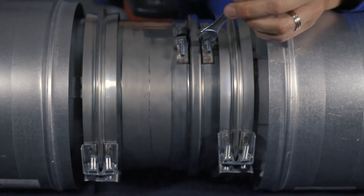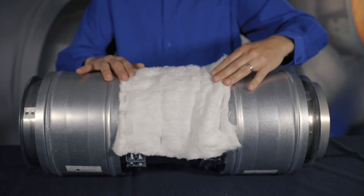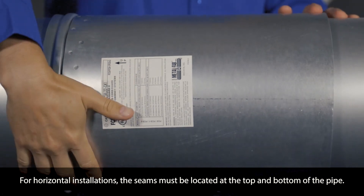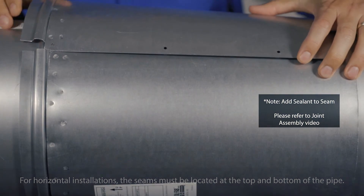For insulation applications, cut the insulation to the desired length and wrap the inner pipe, ensuring that it is covered completely before attaching to the outer half jackets. Wrap the two half jackets around the joint with the bead at the downstream end and the punched edge overlapping the raw edge by approximately ¾ inch.